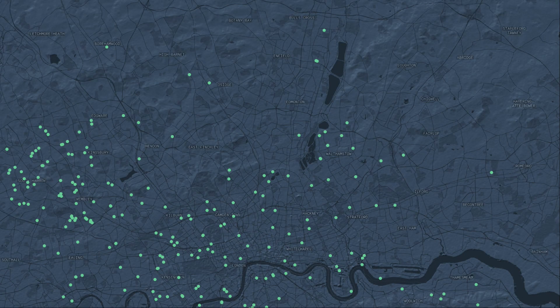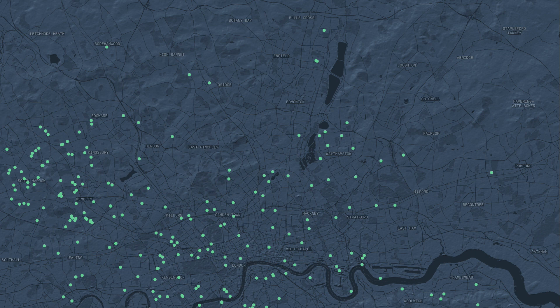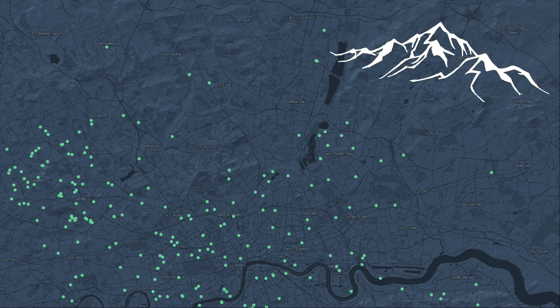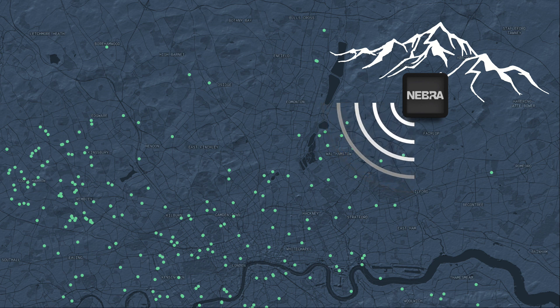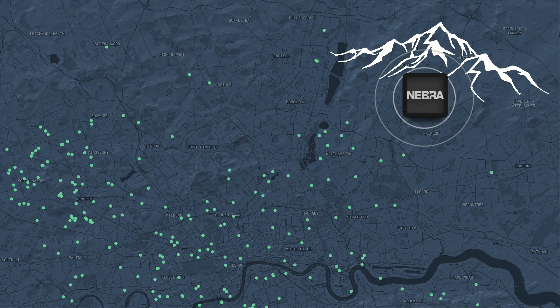Let's consider this hypothetical example. We're going to set up our miner in the center of the city and use an omnidirectional antenna to send out radio waves in all directions to interact with as many hotspots as possible — this is considered the ideal scenario. However, there might be a mountain range or something behind you. If that's the case, you could try a directional panel antenna to see what kind of results you get, but I'd still recommend starting with an omnidirectional antenna first.